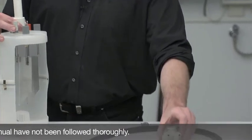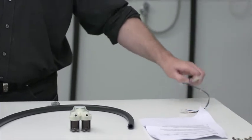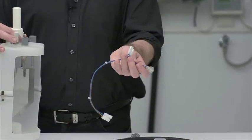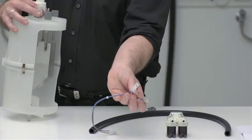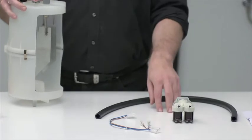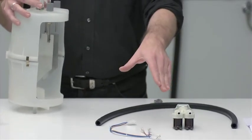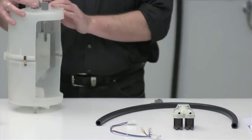This double solenoid valve replaces the single solenoid valve and then all that remains is to connect everything electrically, and that can be carried out by simply hooking it up to the controls of the blow down pump. It is a very small cable harness. We will use the pump's power supply for the solenoid valve and in doing so we will achieve the following: the solenoid valve for super flush will always run parallel to, that is to say at the same time as, the blow down pump.